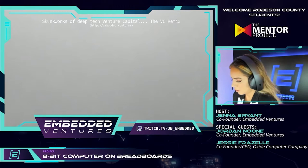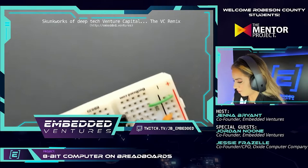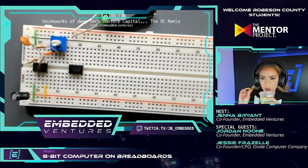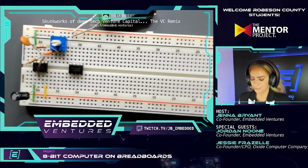Move it slightly further — maybe three or four pins further to the right — so the pins aren't in the same rows as the potentiometer. I did that too when I first built it. When I think about the board I think right-to-left as the current direction, and half people think it's that way and half think the other way — both are right. That looks good — that is step 2.1.2, placing the timer on the board bridging the gap in the middle.